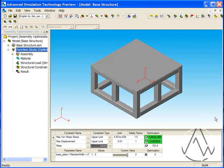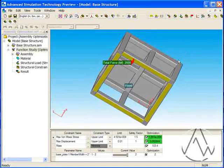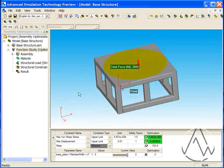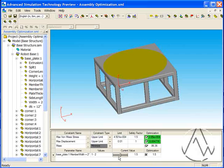I've opened the advanced simulation technology preview for Autodesk Inventor Professional. I've gone through one of the tutorials supplied with this utility and I have the results displayed on the screen. I've created a functional study of this assembly. I'm going to right-click on the functional study and view the current attributes. I've got a loaded force sitting on top of the assembly, and if I spin the assembly upside down, you can see that I fixed the bottom of all of the t-bars. This interface allows me to define a parameter from the original model, and we can optimize the design of the assembly based on that parameter — evaluating what size steel structure would best suit this design.